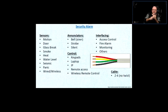The reason that 3 things have to be present is so there are no false alarms. If there's a cat walking on the countertop and the cat drops the glass on the floor, you're going to have the high frequency sound of the glass breaking, but you're not going to have the low frequency rumble of the window just before it breaks, and you're not going to have a sudden pressure change, so no alarm, and rightfully so. You don't want false alarms, because false alarms are bad. But also, if there is lightning outside, the windows might rumble a little bit, but there's no high frequency pitch of glass breaking, and there's no sudden pressure change inside the room because the windows are still closed. Okay, so that's how the glass break works.